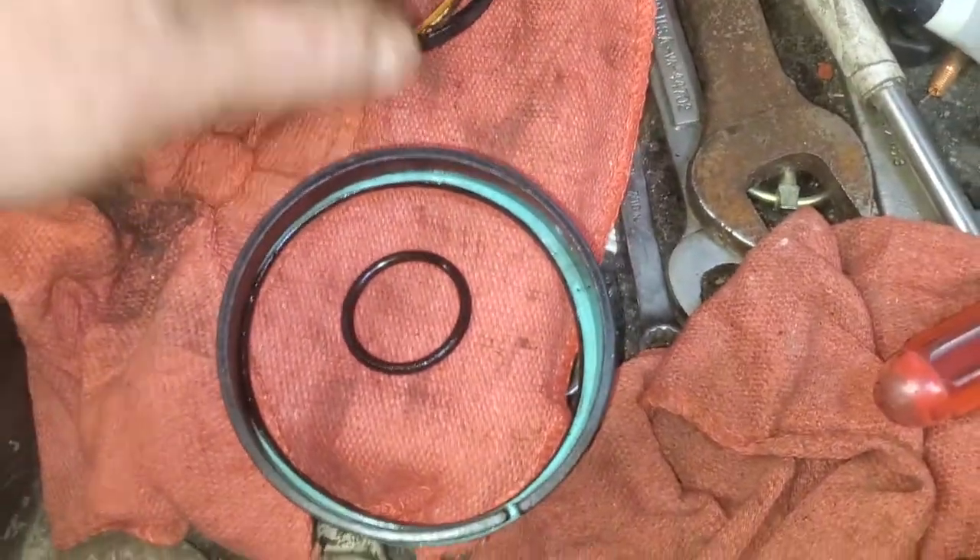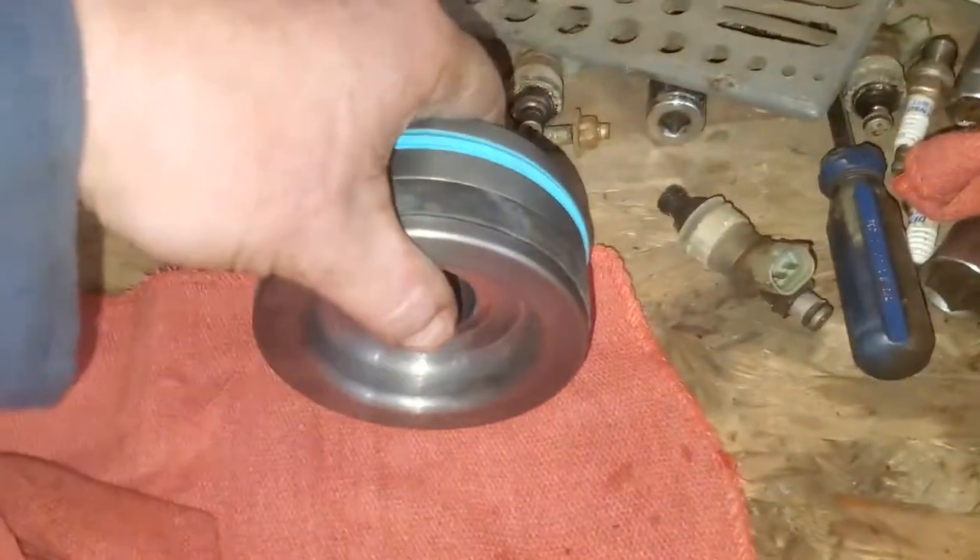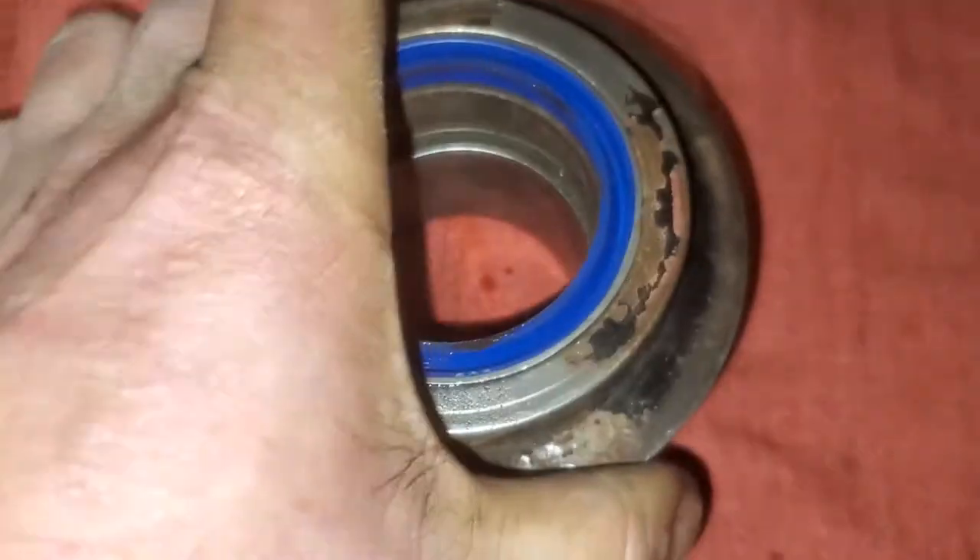Here's a new kit — these are the parts, and here are the old ones. It's really quite easy. Here's the cylinder, that's the head that pushes, and the back has a big nut on the end. There's an o-ring that sits here, and these are what's inside. The kit from Nedland is right around a hundred bucks. This is the one that sits on the very outside where the snap ring comes around.